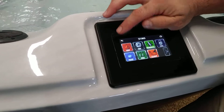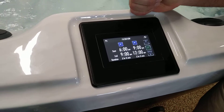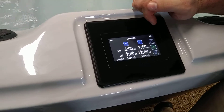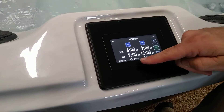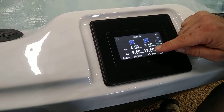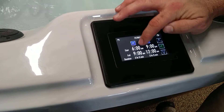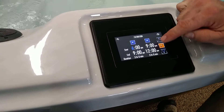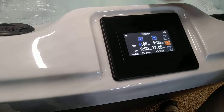So we'll click right back out of here. This is your filtration times. A lot of people call us here at Spa Kingdom and want to know how to make adjustments on their filtration cycles. You're just going to go right here in the filtration menu. You're going to set your start time here and end on this bottom number down here. Right now we have it set for 6 a.m. to 9 a.m., which is a three-hour duration, and then in the evening from 9 p.m. to 12 a.m. If you want to make adjustments, just click on the actual number itself and then you can adjust it up and down once you get it exactly where you want it. Also pay attention to the a.m. and p.m. — if you set it from 6 a.m. to 6 p.m. it'll run for 12 hours at a time.